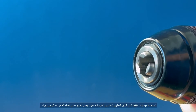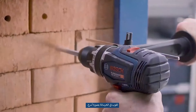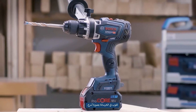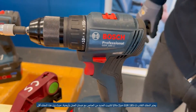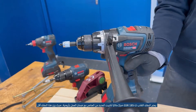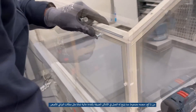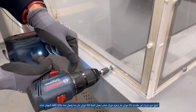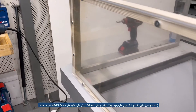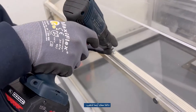GSB models, for example, with an impact mechanism, are used for drilling in concrete. The percussion in the drills works in accordance with the direction of drilling, so you can drill a hole in concrete faster. Drill drivers are great for screwing and unscrewing screws of various sizes and lengths. The GSR185LI is a tool that will be perfect for places where we have a lot of elements to be screwed in and, above all, we want to work comfortably. It weighs less than a kg and, thanks to its compact size, will perform just as well in tight spaces as smaller 12V screwdrivers. The 21 Nm of soft torque and 50 Nm of hard torque will work well for most everyday tasks. This model should not be missing from your kit.